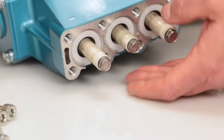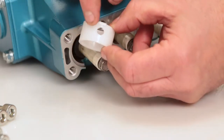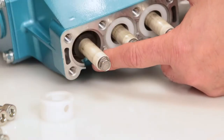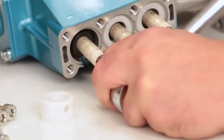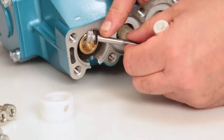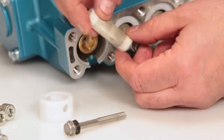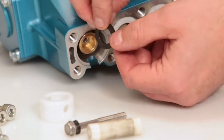Before reinstalling the manifold, be sure to replace the plunger retainer gasket included in the seal kit. Begin by removing the seal retainer, which has two holes — one has a tab that is installed facing down into the slot of the crankcase. Using a 10mm wrench, loosen and remove the plunger retainer and plunger. Inspect the plunger retainer gasket, then inspect the ceramic plunger for cracks or scoring. The barrier slinger is located behind the plunger and is used to prevent water from entering the crankcase.